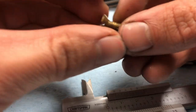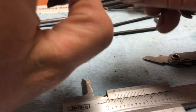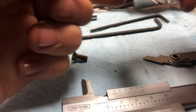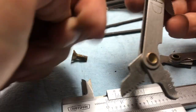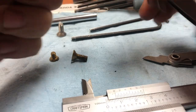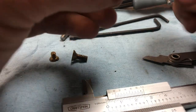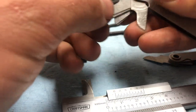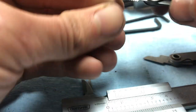And then our other two screws here, these are probably standard thread. It's probably smaller than 1/4-20 for sure. So we're going to go down to 12-24 or 12-28 because it looks like it could be about the same size as 5mm, just a hair smaller, but not quite all the way down to 10-32. That's a smaller thickness screw.